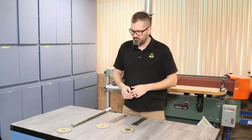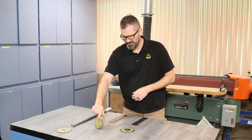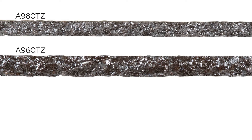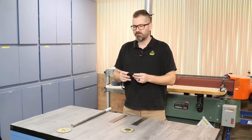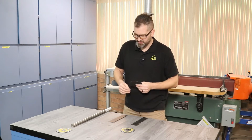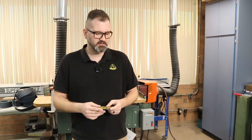After that, we move up to our most popular cutoff wheel, the A960TZ. The 60 grit still gives you a very smooth cut, and the 0.045 thickness is the most popular on the market today. It also gives you a very fast cut. You can actually get up to a quarter inch thick pieces — much thicker than you can cut with the A980TZ.